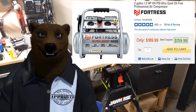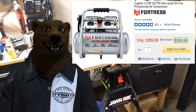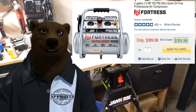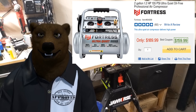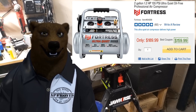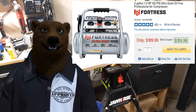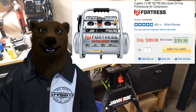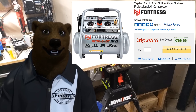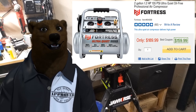I've got to say — fit and finish, when you walk right up to it, the first thing you notice is the fit and finish, and the Fortress is miles above the CAT. The CAT gives the impression it was slapped together in someone's garage, whereas the Fortress has a real professional look. The grip on the handle is better, the knobs are better, the gauge alignment is better, the air hookups are better. The tank is beefier — and it's aluminum rather than steel, so no rust, no condensation worries, no concern about it failing. It's got a full roll cage versus a half roll cage on the CAT. And it has a cord wrap spot with two built-in prongs on the side — the CAT doesn't even have that on a portable compressor.